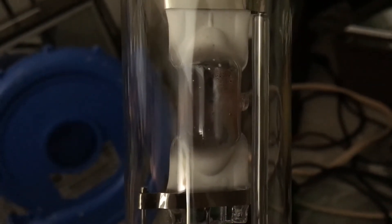Here's our probe start resistor, and here's the arc tube itself. It kind of looks like a standard metal halide arc tube, but it's actually not, because there are violet halide salts that make it blue, basically from the Mercury. If some of these halide salts get touched or ionized by the arc stream, it'll actually give off a violet color, which is very cool. You can see all the little spots of Mercury, and a little quartz tube preventing the lead wire from melting. We have the top supported by the whole bulb itself, and there's no dimple since this is a tubular-shaped bulb.